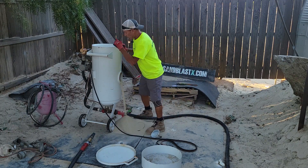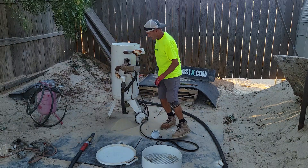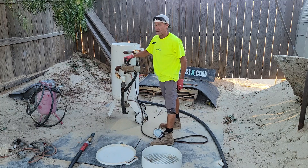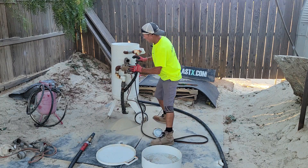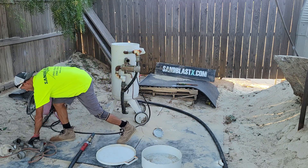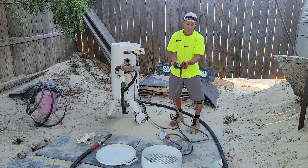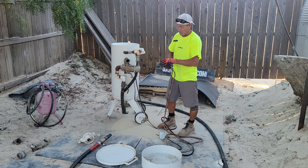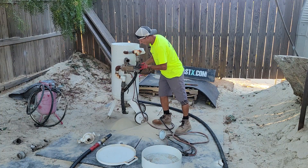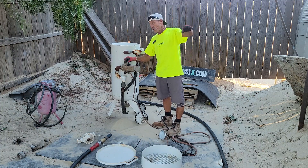The thing is much easier to manhandle now that I got all that sand out. Here's your air hookup right here. Your air is coming in off your compressor, going in right here — this is going to pressurize the pot. This is run by a dead man, which is this unit. These plug together. This is your on/off safety switch. That energizes this, pushes the cork up, pressurizes this, and starts shooting sand.